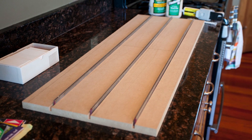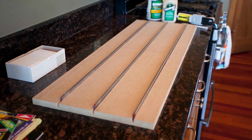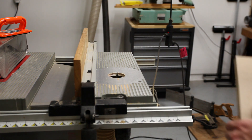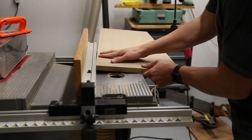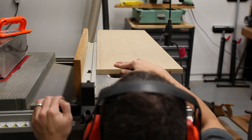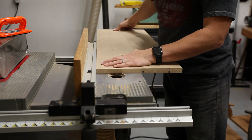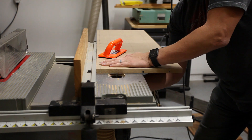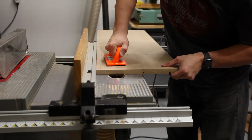With the Mr. Sawdust table, you basically have two sheets of three-quarter inch MDF or plywood, and you sandwich steel bars in between so that your table remains really flat and doesn't flex or bow over time. This is really important because if your table isn't completely flat and has some bow or warp to it, all of the accuracy and calibration you do to the machine basically won't do you any good. Your main goal is to have as flat a table as possible, and then align the saw to that table.